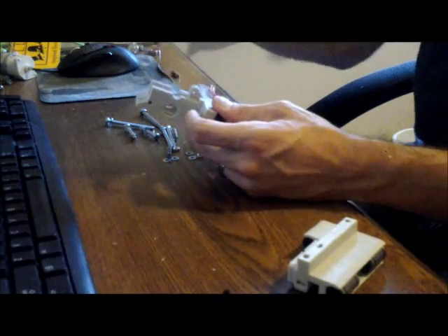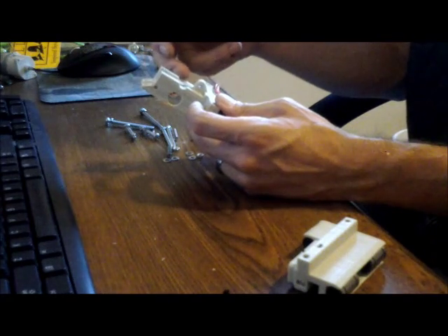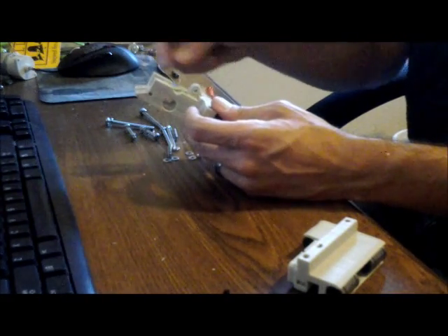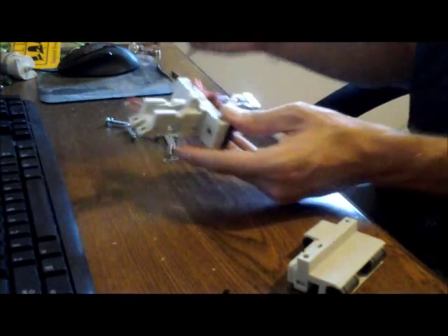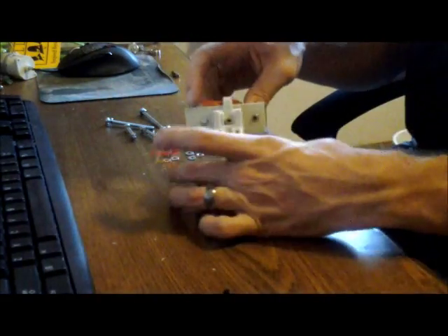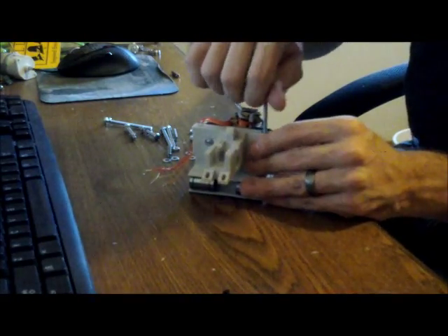That's the only good way — either that or if you have a long drill bit, that will work really well too. Be able to drive it all the way down and make sure that it's nice and lined up. So I'm going to attach the hot end here using some M4 screws by 60mm.